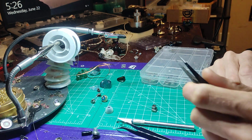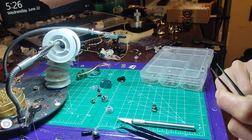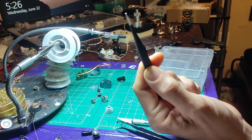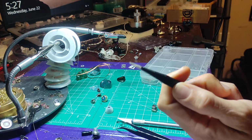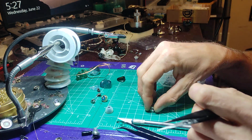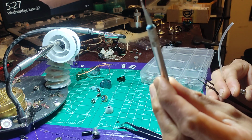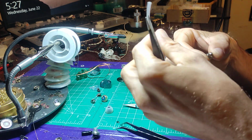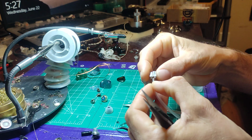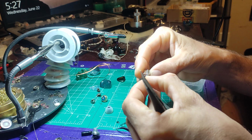Now, ideally, you want an IEM tube stretcher. It's called a BTE. IEM BTE tube stretcher, but what I use is a pair of tweezers. Okay, ESD safe tweezers. Take your tube. I have 2mm tube here, and you're going to also need a razor knife. Okay, here's your razor knife. And what I want to do is I want to get the tube to fit across both nozzles, and you can actually see that the gap of the tube will fit in between the nozzles.